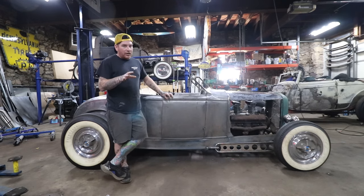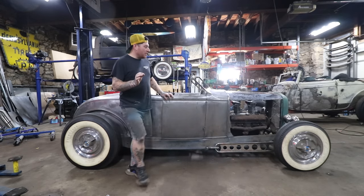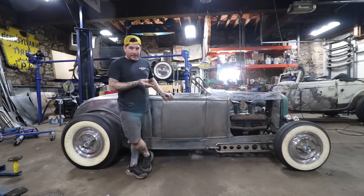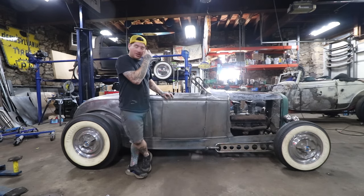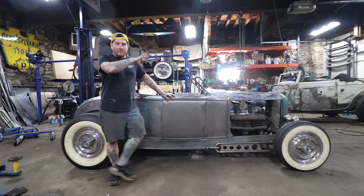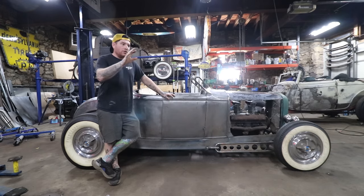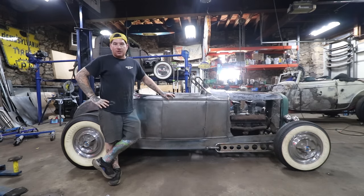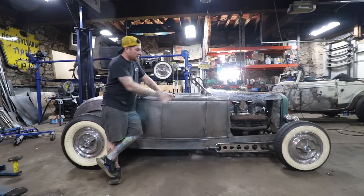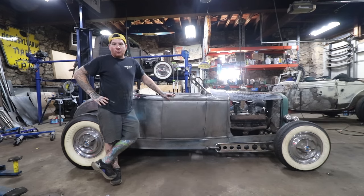Next video I'm going to try. I know I said at the beginning of this video, it just didn't work out. I was too ambitious. I'm hopefully going to have most of the cowl and the dash metal work to the point where I can start doing some leading. I know a lot of people have been asking about that on the channel, so I'm going to try and do some leading on these body lines and the cowl area, in the top dash to cowl unions. There are some areas I can't get in with a hammer and dolly to fix, so there are some low spots that would be perfect for doing leading. That is the goal for the next update on this car, to have some of that ready, and we can do the top of the cowl and show you guys making things nice and smooth using old school lead work.